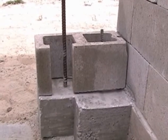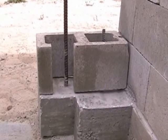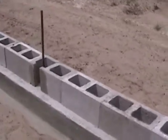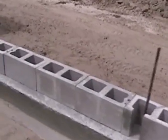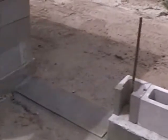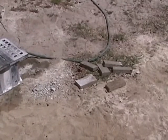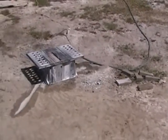Notice how imperfect the foundation is — different gap spaces underneath the block. This is why you have to mortar the first row to get everything back normal. When people pour foundations, they do not do exacting work. In this video clip we're looking at a test placement of the first row of blocks. When you're uncertain about a wall segment, you might want to drop the blocks in place and see how everything works out. The second row has to work out too, not just the first row — so if you're really concerned, stack the first two rows as a test case before mortaring. This cheap table saw with a diamond blade is what I use to cut the blocks. I cut my own inspection blocks and don't have to bother with special ordering.